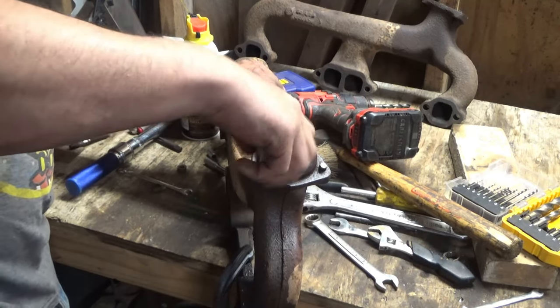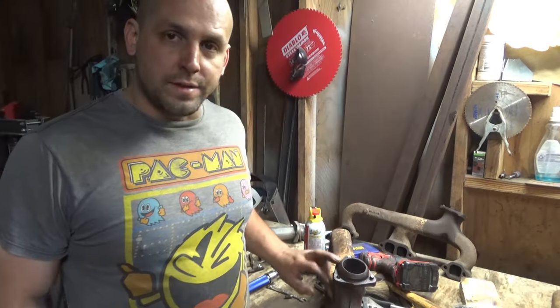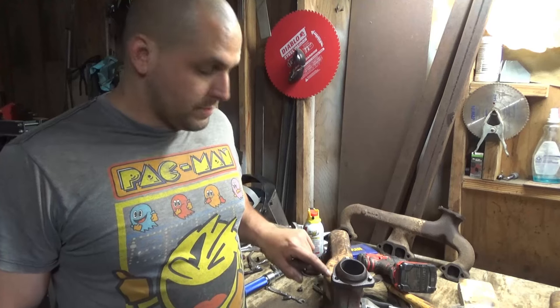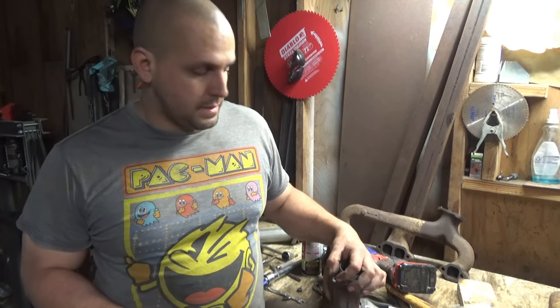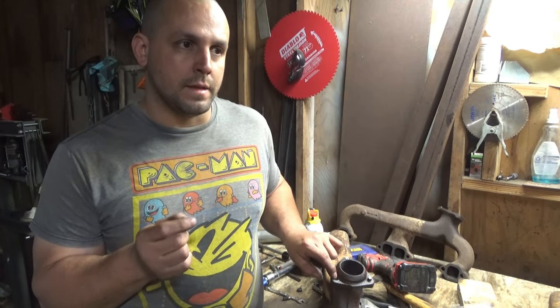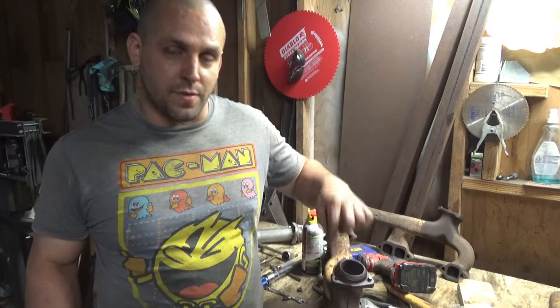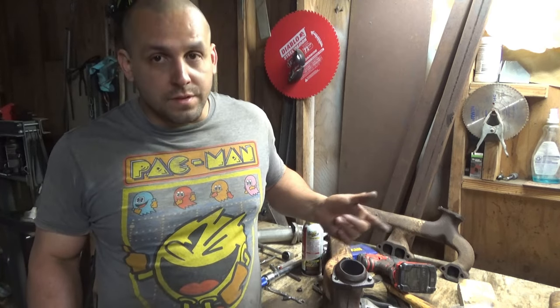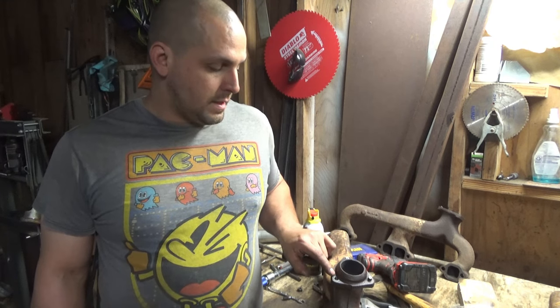Now I've got three more to go. Remember: get the piece out, don't do it like that — that's the wrong way. So this is a fail video. Another way to do stuff like this — it doesn't always work on this — but you could figure out a metric bolt, a metric stud that's just a little bit bigger. Because if you do the next standard size up, it'll be a lot bigger. But usually there's a metric size that's just a tiny bit bigger — probably whatever a 15 or 16mm head is on. You can usually do a metric and just go for the next size bigger.